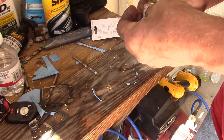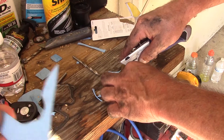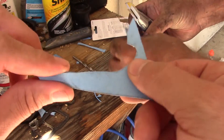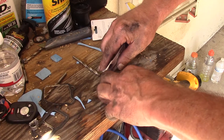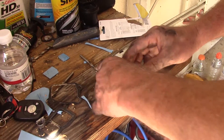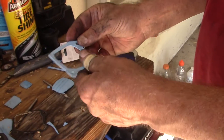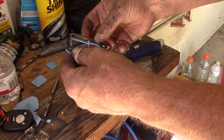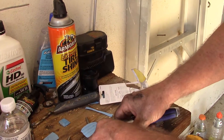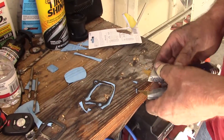Now you've got a clone of the old one. You can finish cutting it out from the back. This material isn't very rubbery — it's got a hardness like cardboard, but it evidently has rubber in it. Using the drill bits to hold it in place gives good alignment. This is the second gasket we made; just clean it up with a nice sharp knife, and then put it back where the old one was. That's all there is to it.